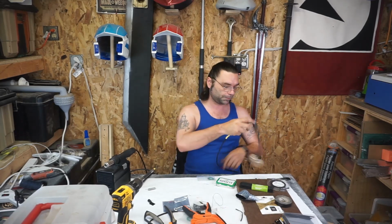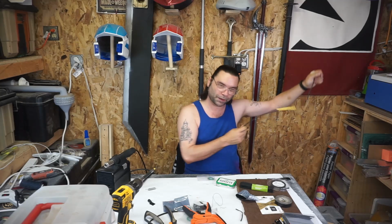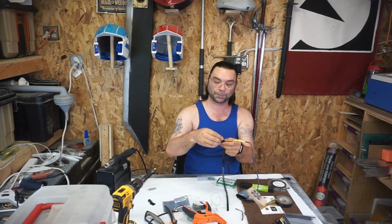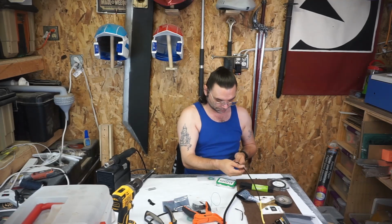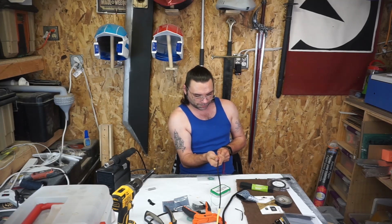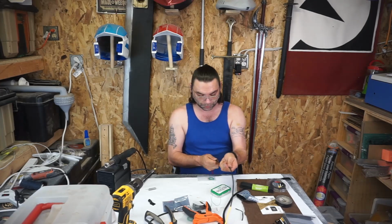Well, let's see where we're at. So my 3 buttons. I'm probably about there. I could stop at this point. I may. I don't know. I also have that wrapping kind if I wanted to. I'd rather not. So always make sure you calculate for the largest possible wire you're going to be using. And for me, 3/16 is a little too small. Probably should have gone 1/4 inch.